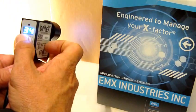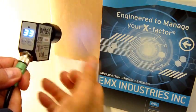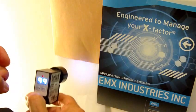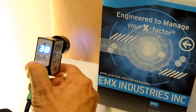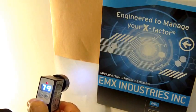The display, ranging 0 to 99, is an indication of the relative intensity of the light reflected from the surface of the target. Right now we're reading around 38. If we look at a light color target — the white copy paper — we're reading much higher, in the 80s. And we can see that the discrete output is activating and deactivating as we cross the threshold.